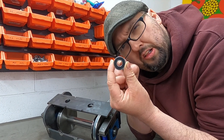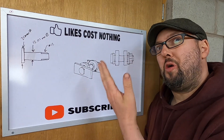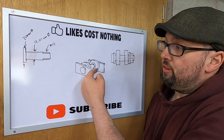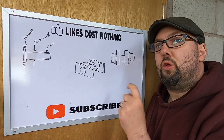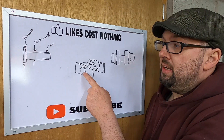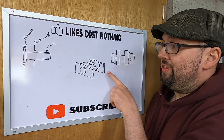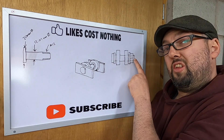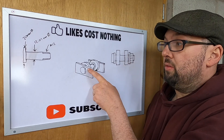That push fit into this 12 mil hole. So here we are at the drawing board. The idea is we have two plates either side with a pin that runs through, with the two bearings either side, with a slight gap in the middle because we don't want the two bearings too close together — we want to spread out the weight as much as possible. The pin is going to have a flat on one edge so we can weld on a plate that will stop the pin rotating. From the side it'll look like the pin head and pin body running through, with a nut on the other side which will have a pin through it to stop it coming undone.